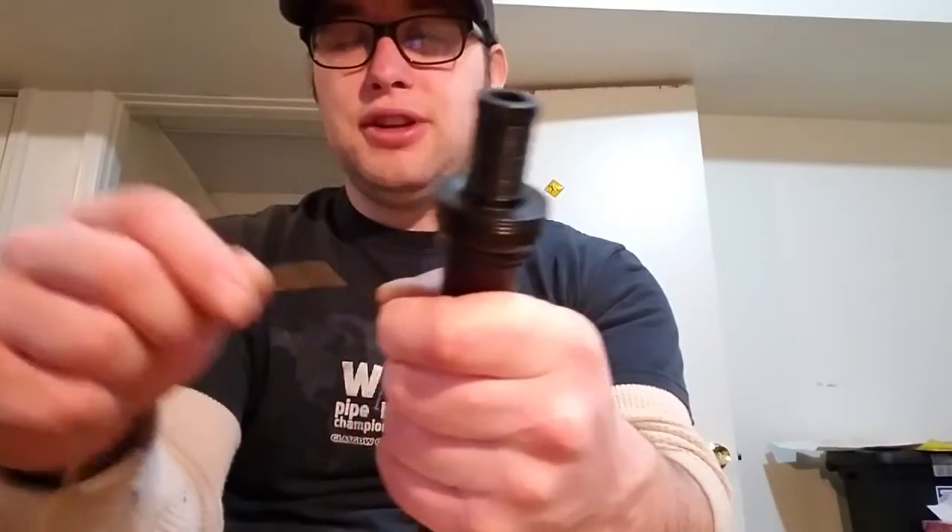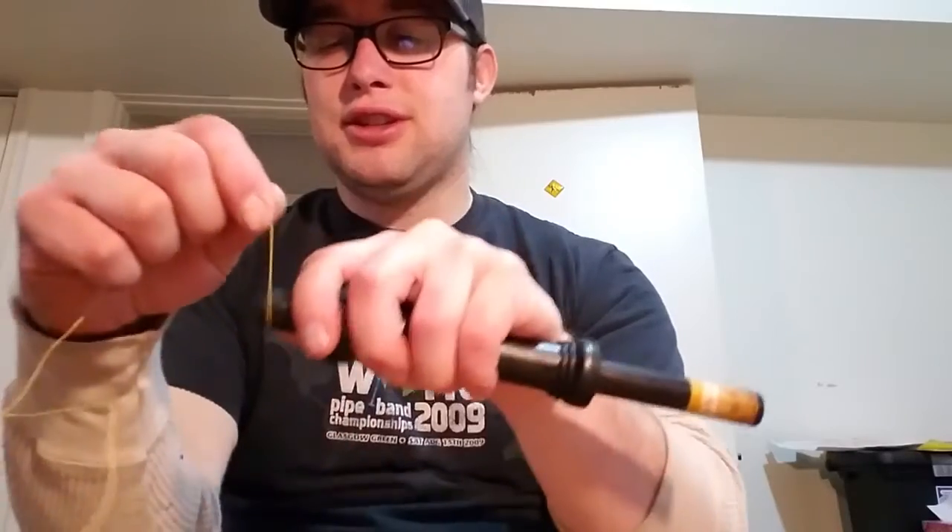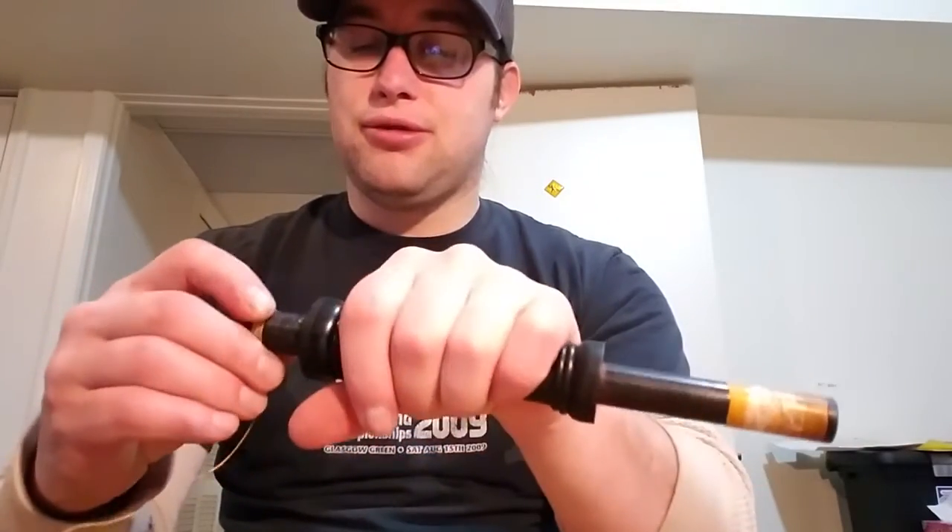When you're starting your hemp on a certain joint, you'll notice that pipes have these little grooves. The intuitive thing to do is to keep the hemp right in those grooves and try to keep it even as you work your way down. However, I've found that this just creates a groove spot for the hemp to sit in and actually makes the spinning problem a little bit worse.